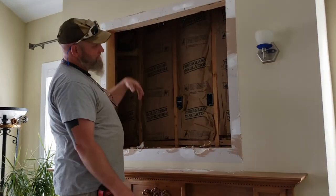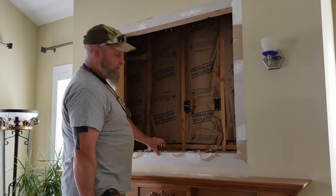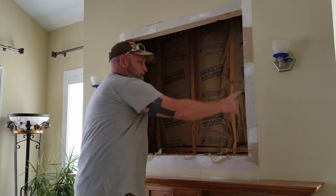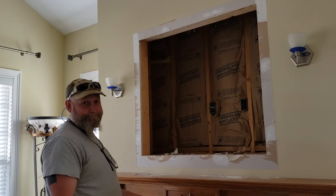I just write my measurements down on the sides. So we've got a 40-inch space, and these are thirty-six and three-eighths. Two by fours are one and a half inches wide, so we'll do our thirty-six minus one and a half when we cut these.